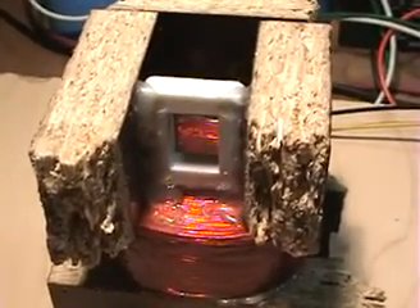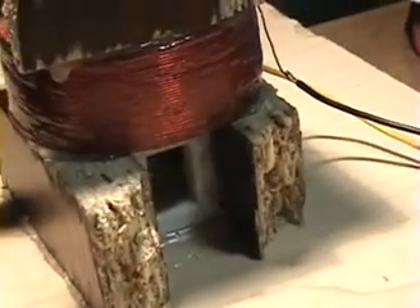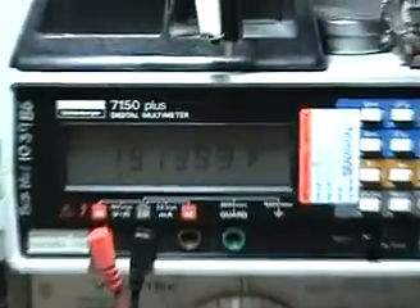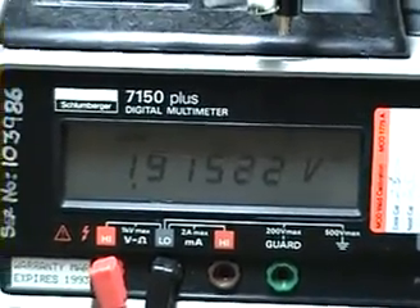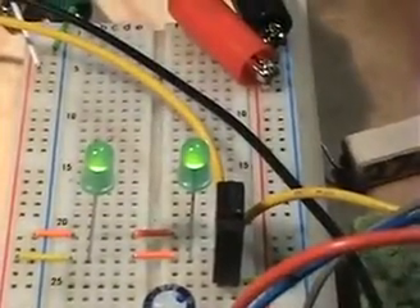That's the kind of coordination you want to achieve, and that's when you get a better output. We're now at over 1.91 volts, and it's maintaining that with a load of those LEDs because our capacitor bank is large enough to keep an average voltage.